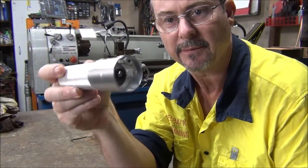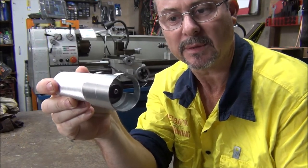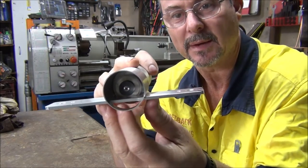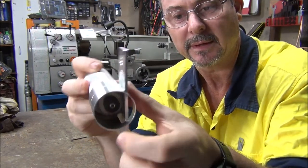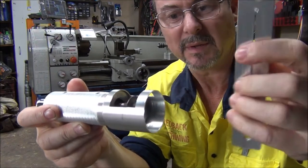I've got another job. Hopefully it's a quick one. This is this jump ring maker again. The trouble he's having now is the depth of cut. The blade doesn't sit out far enough. It sits that way and he cuts the jump rings, but there's no adjustment for the blade to come like the depth of cut. So what they need is this section here cut out 1 millimeter deep.